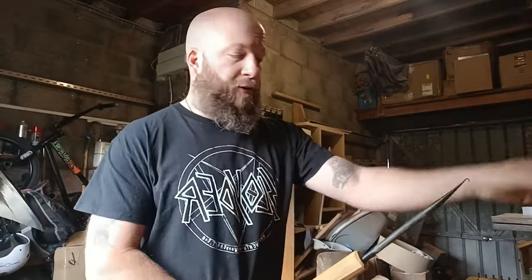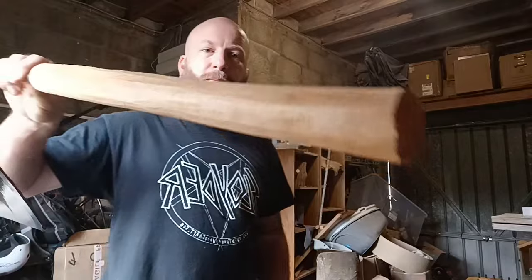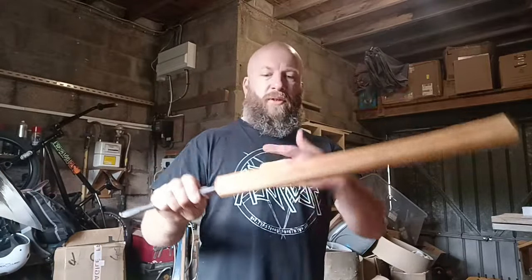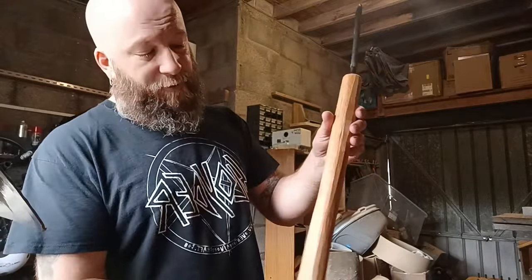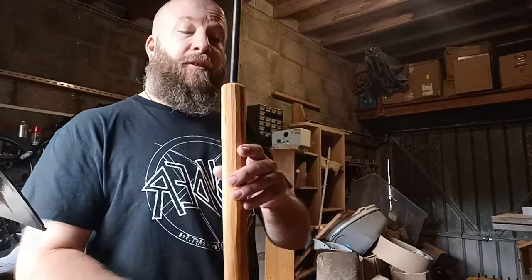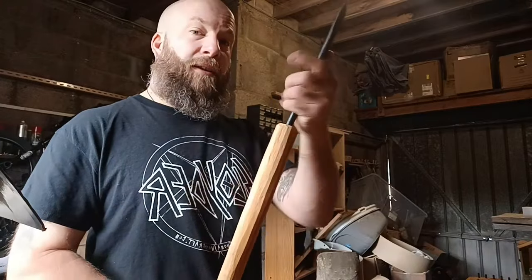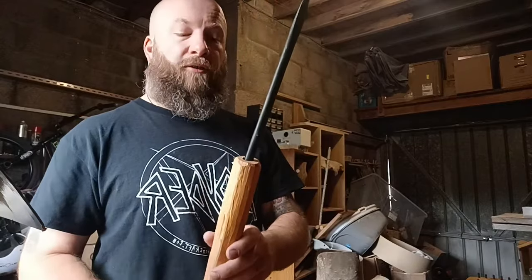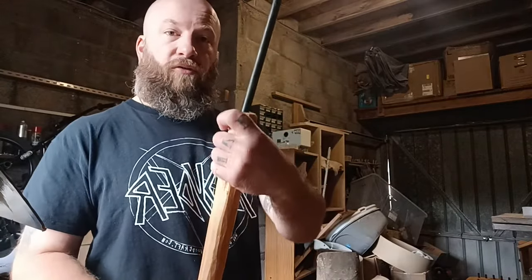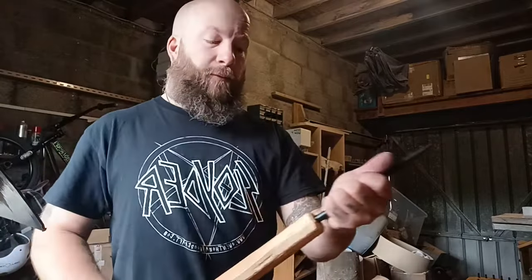And these are all from Owen Thomas and the t-shirt. The handles are made of alder. I did these very quickly. These were knocked up through cleaving an alder log down, working it to sort of round. They're good enough for what they are. And the key thing about them being green is I haven't used any glue when knocking the handle down onto the steel of the hook tool, because I want the wood to shrink around the steel of the hook tool and therefore grip it and it won't come out.